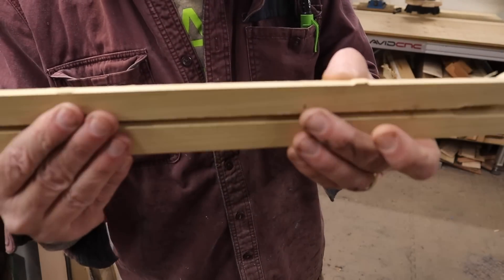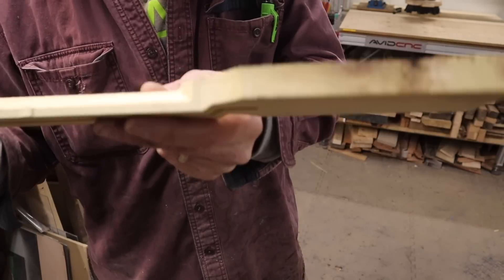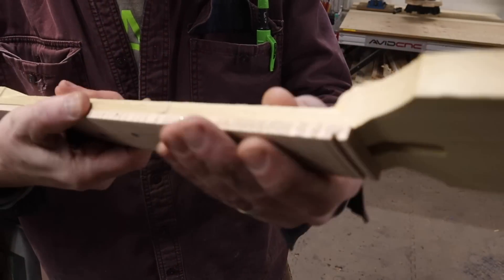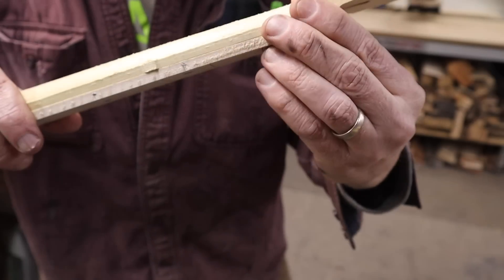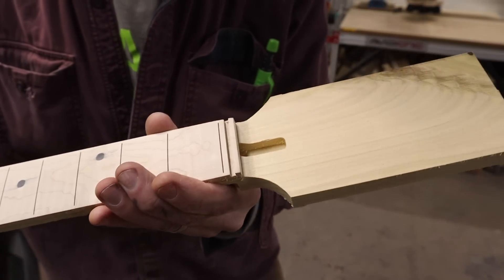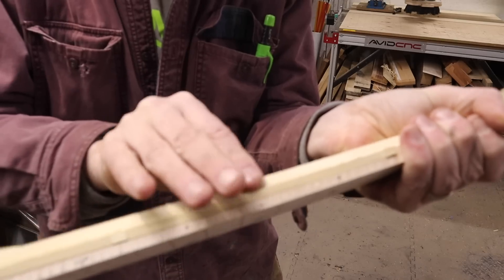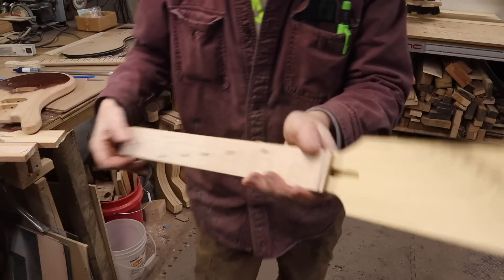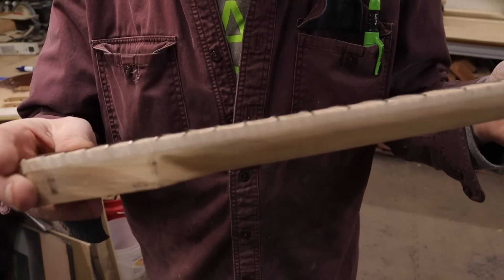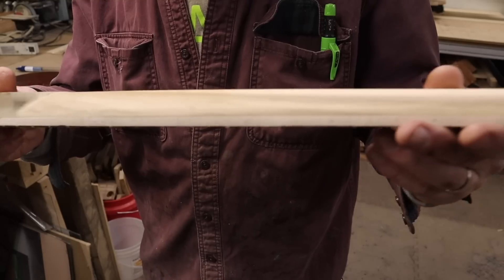You can see I left the tabs on the side - I haven't cleaned them up yet. The way I machined and designed this file, there's a little bit of extra wood there - I didn't run the toolpath all the way down to finish the entire arch shape of the neck, and I did that on purpose. One reason is to save time, the other is to make it easier when gluing - you've got a better edge. Without that bit of wood there it'd be easy to chip it away before you glue the fingerboard on where it's really thin and unprotected. You can just line this stuff up right at that slot and get a nice glue seam going all the way down. This neck is sanded to about 120 grit, because that's how it'll come to people who purchase the pre-made parts - they're not all the way finished, just roughed in.